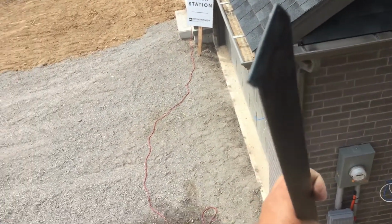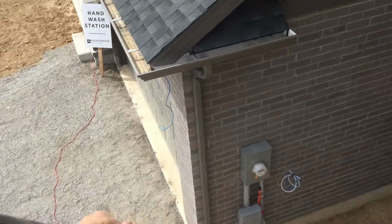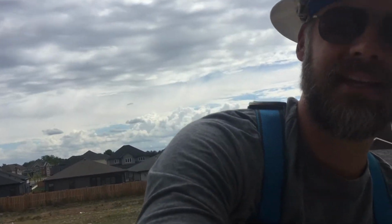When you're doing this kind of aluminum work, you never want to have a raw edge. If you have a raw edge, someone's always going to notice it. And when you're working with it, you're going to cut yourself. I got some on my arm right now from not being careful. So anytime you can look a little more professional by folding that edge over, and just leave yourself an extra 1/4 inch or 1/2 inch of material. Actually, at least 1/2 inch of material, 1/4 inch is too small. Leave yourself extra so that you can always do a little safety hem and just make it look better when you're finished up. All right, we'll get this last piece on, we'll get it caulked up, and then I'll show you what it looks like when it's finished.